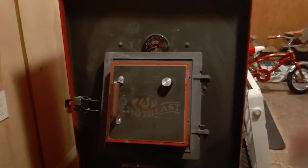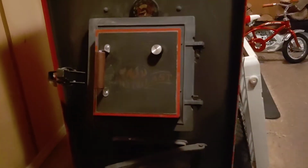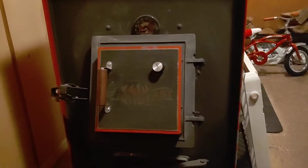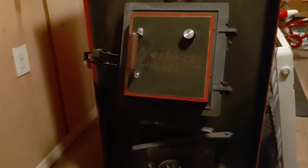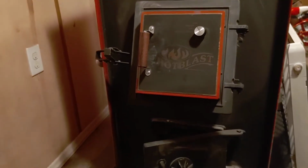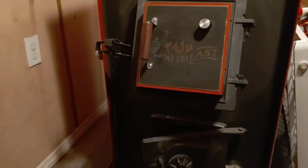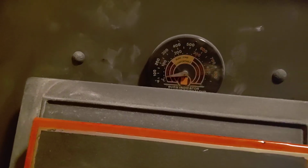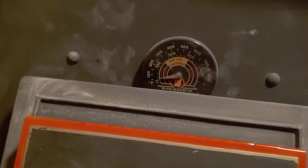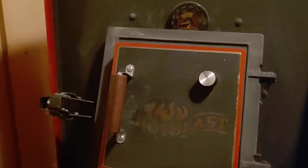It's not just dump the coal in there and let her go. You have to actually layer coal in to fill a 30 inch bed. And I think I said in my last video, I tried half a bed, blah, blah. None of that works. You could get away with it, but I guarantee you're going to find it's more trouble than it's worth. You want just a nice, fine little layer across here, and you're going to have this stove burning anywhere between 300 to 450 degrees just fine with 25 degree temperatures outside, and you're going to be comfortable. You're going to be fine.